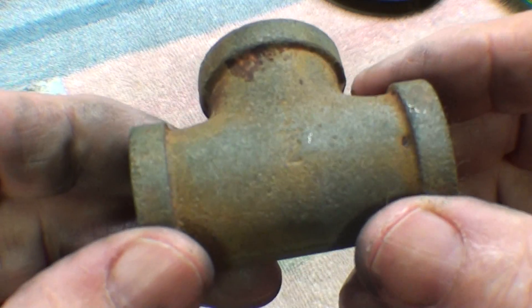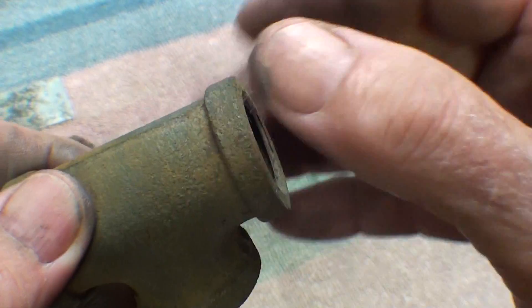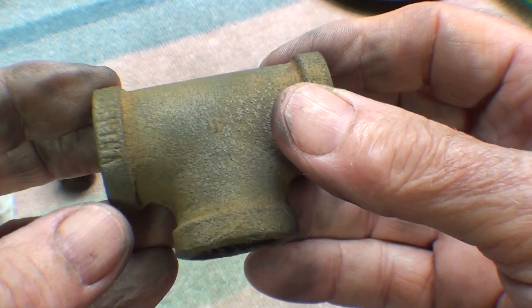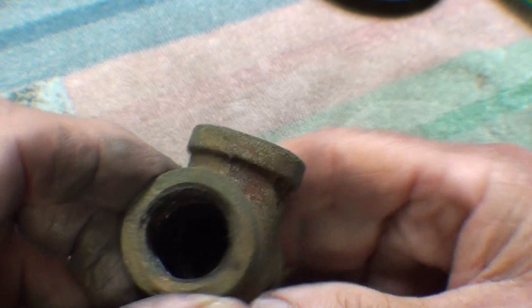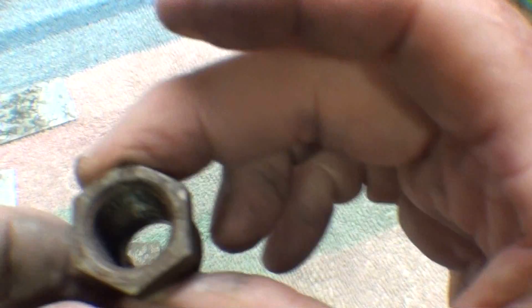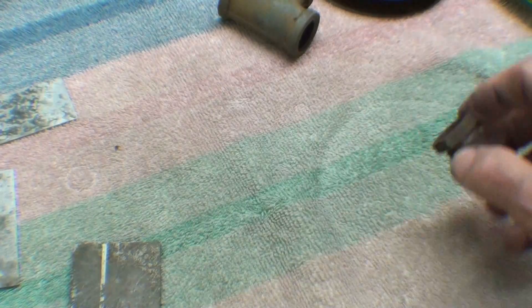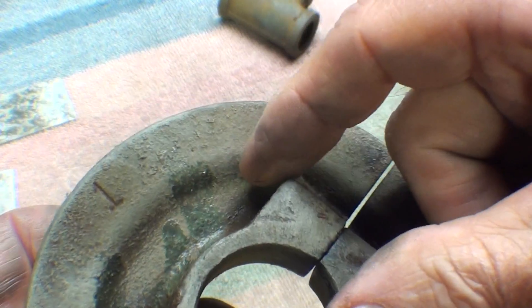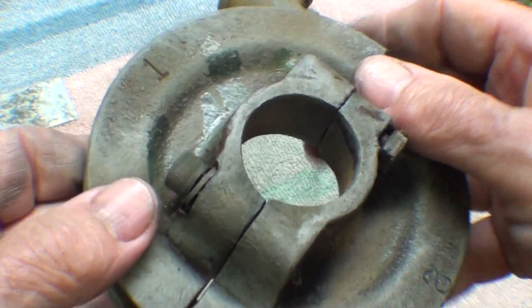This was malleable iron as far as I understand it. It feels rough right around here — it actually feels like coarse sandpaper — and these fittings are relatively smooth to start with, as you know. Again, this was not galvanized; that was half-inch black tee used for gas line. You can't tell anything from this part, and I do believe there was oil on here. We know we can't have oil, grease, or paint, and you can see where there was some paint on the pulley too. It didn't take the paint off — in fact, the paint protected the base metal.